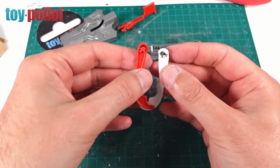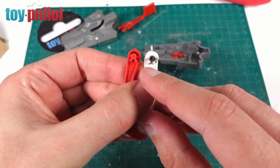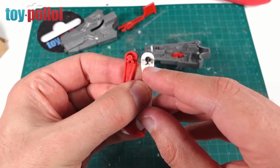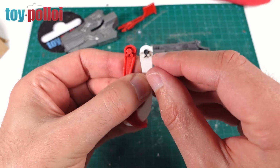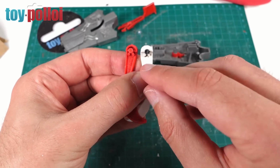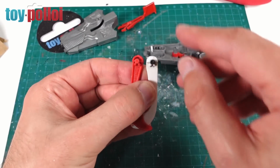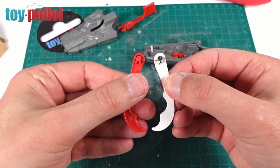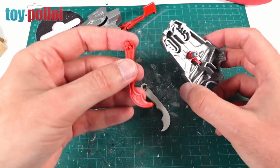And then on the bottom I have constructed, it's a bit messy, but you can see there's two little gears here, and these are vital for how it works, and these have taken me quite a while to construct. They're about 1.5mm thick, and I've just been cutting and tuning and modifying as I go. I stuck them on, originally they were too big, so I've been filing them down and cutting them, and it really has just been a trial and error process, but I've ended up with something that does actually work. So let's put this back together again and I'll show you how it works.